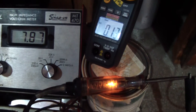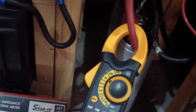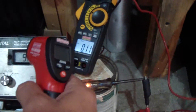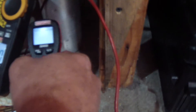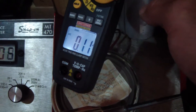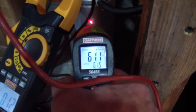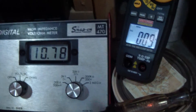I'm going to disconnect it and check the temperature on the capacitors. The ambient temperature right now is about 60 degrees Fahrenheit. I'm going to use the infrared temperature reader to check the capacitors — reading about 58, maybe about 61 and a half degrees — so about a degree or two warmer. They warmed up slightly.